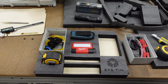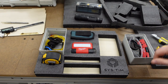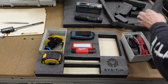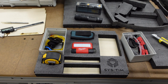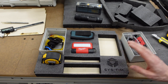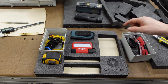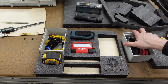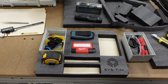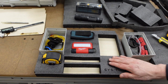Here's what I've been doing: I had thought about using this Kaizen insert, the pre-CNC fitting foam. When I was looking around at my scraps, I found a fair hunk of the same height Kaizen foam, all black — looks like about an inch and a quarter in height. I decided to try it on the laser. I've not done any foam on the laser and I thought, why not give it a try? So I carefully measured the outline — most of these are just simple rectangles. I tried to get it pretty close, using my calipers and rounding up or down depending on my confidence level. I used Autodesk Fusion for that, but really it's just a 2D vector file, and then I just cut it on the laser, doing some test runs to figure out engraving size and depth.